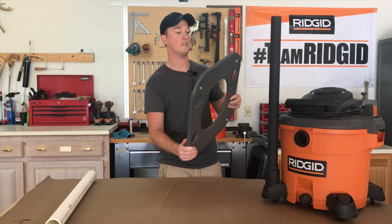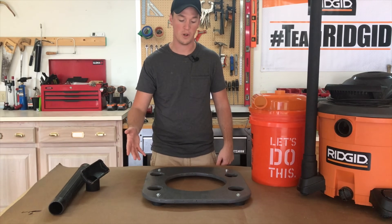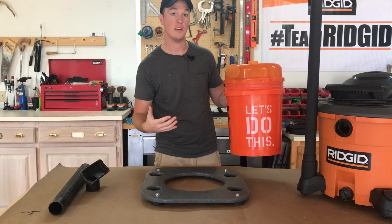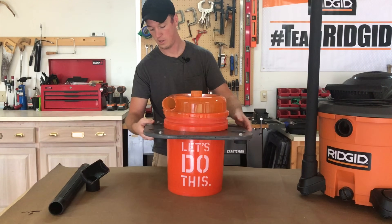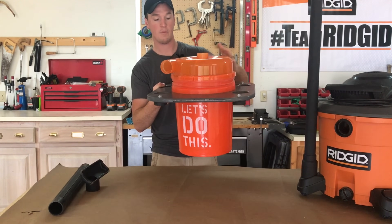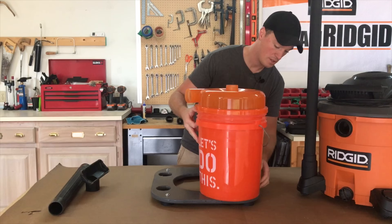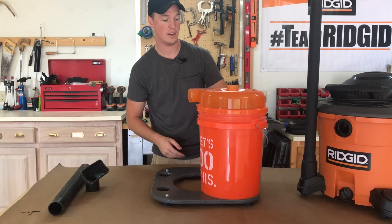With all four legs done, all you have to do is just pop the caps on the pipe — that's it. This is just a scrap piece I had laying around, it's 20 inches by 20 inches. I found that the diameter just under the lip of this bucket is about 11 and one quarter inches. So I marked that out, cut my hole, and the bucket just sits in there. A little bit of play, but the 11 and a quarter inches was a pretty nice fit. After that I took the bucket, laid it out, traced and cut the corners out on the bandsaw.